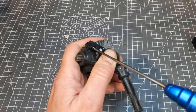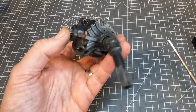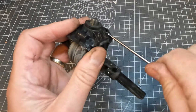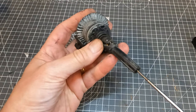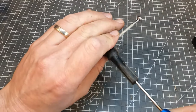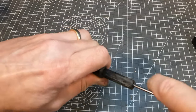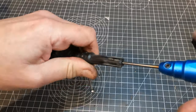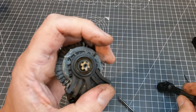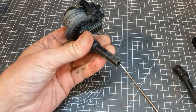There are a couple of screws to get this casing apart. It's not a bad idea to take a photo of which way up this is and which way the gear goes into it so you can get it back the right way later. You need to get the drive shafts off — the easiest way is to put a long 2mm hex down through the middle. You can jam another screwdriver in there to stop the drive shaft spinning while you're trying to undo it. Once that's undone you should be able to pull off the shaft. It's just the same again on the other side.